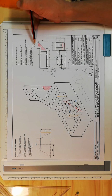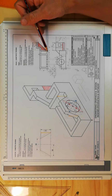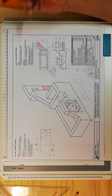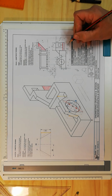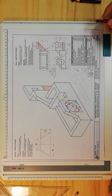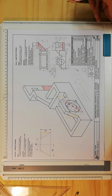You can also see the same thing over there. So if you cannot find a measurement in one view, please know that it will be in the view next to it. Okay, so you're going to take 136, you're going to add the 58 to it. That is going to give you your total length of your drawing, which we can quickly work out. I don't have a calculator on me now, but it's 136 plus 58. So you can quickly do the maths. So it looks like 194, if I'm not mistaken, 194 millimeters. And simply put, then, the total length of my drawing will be 194.